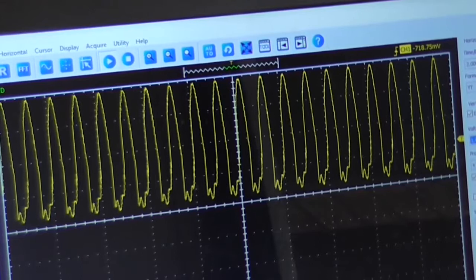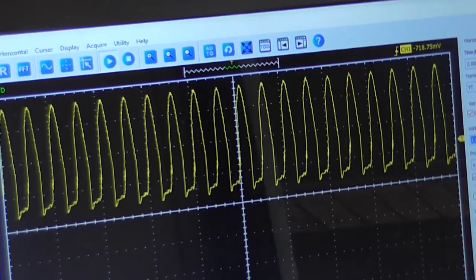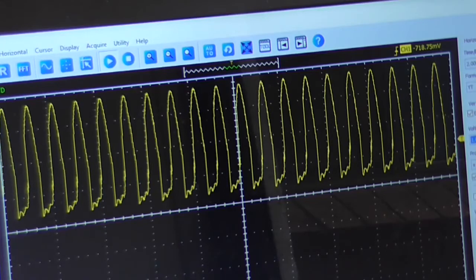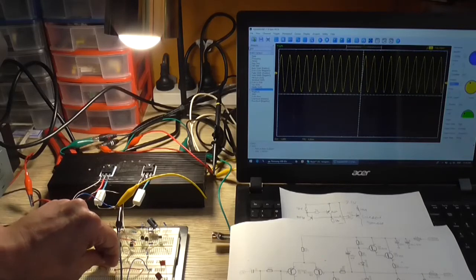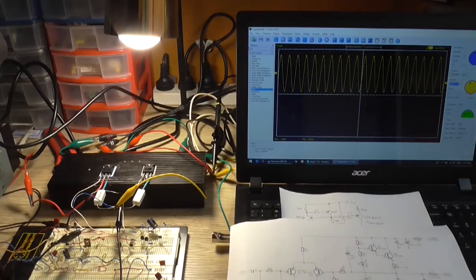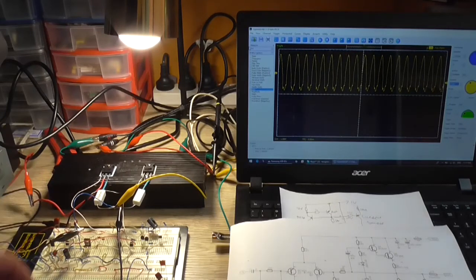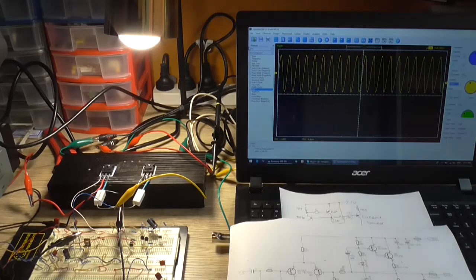We have an output. It's a little strange on the bottom there. So I might back the amplitude voltage off. Yes, that's a good indication that it's not biased correctly now. So we're getting a little bit of distortion. But at least the constant current source to the output stage is working. But if I touch that base lead wire with my finger and bring it close to a ground, well, it cleaned the signal up there, see? So it's just layout here on the board. I also found that when I disconnected the Zobel resistor, the noise also went away. So, I should say distortion. Now the distortion's back because I moved it. So, see, now it's stable. Strange, yes, but there you go.